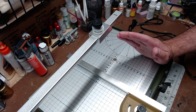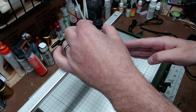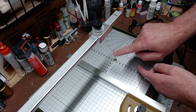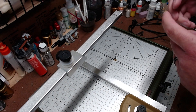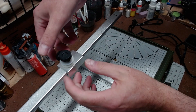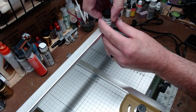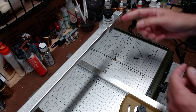Up top there's a rail that goes all the way around, and underneath it basically makes a circuit — when you turn on the electricity, it flows through and heats up the wire. When the wire breaks the machine is dead; you turn it off, fix the wire, and you're back in business. There's a dial back here — you really have to loosen both knobs to move this along the arm. As you move it back this knob tightens it so it won't slide.